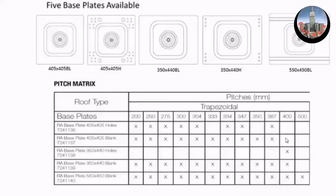These are the plates. Your plates will be this kind of plate, and essentially you have a series of holes. These holes are designed to orientate this way and that way to the most common types of roof profile. You will typically have two rivets per corner — two here, two here, two here, and two here — and you align those holes with the upstand on the roof, which is the raised part, so we rivet those holes to the raised part of the roof.